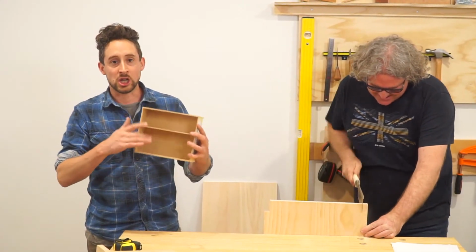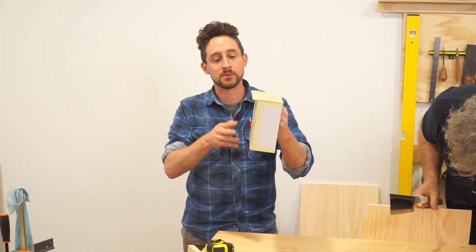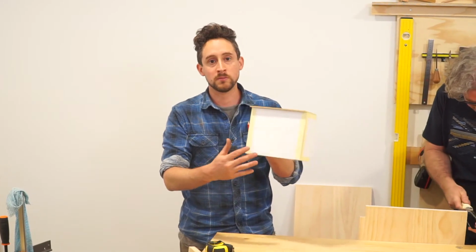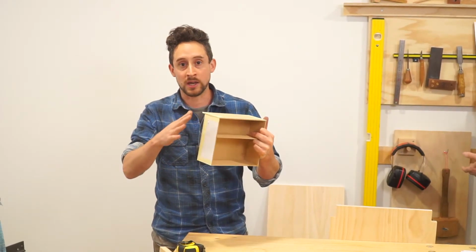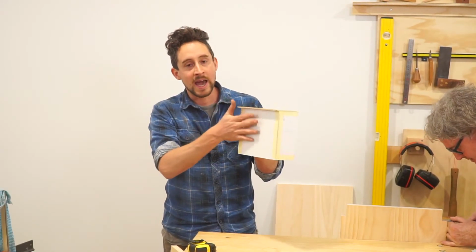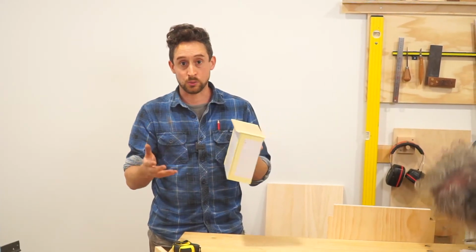As well as the shelves that you can see, on the back, underneath this overhang here, we're going to hang a whole bunch of bar clamps. And that's it. It's a really great place to store the clamps, really close to where you use them. The whole length of this cabinet will be about 1 metre, and with a few other accessories, it'll be closer to 1200. So we can put our 1200mm bar clamps hanging on the back, and we'll talk about the techniques for creating a really effective bar clamp rack next week.